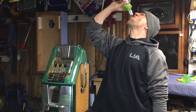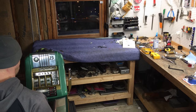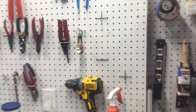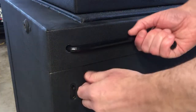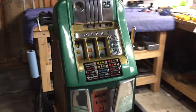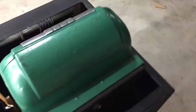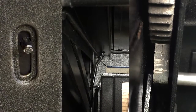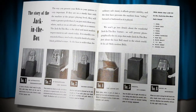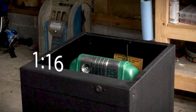With the machine at its maximum height, it's time to gamble. Once you've taken your patron's money — or the law has showed up — it's time to get the machine out of sight by reinserting the crank and providing just enough pressure counterclockwise that the dog can release and drop. With the dog out of the way, the machine slowly descends from its own weight. There's also a leather strap on the other side of the spool that helps with this process. As the platform finishes its descent, it moves a part attached to a rod within the inner frame which pushes the dog back up, locking it back into place. The original advertisement says this process of descent happens in 10 seconds, but I timed it out at 1 minute and 16 seconds. It's probably better to be slower than faster.